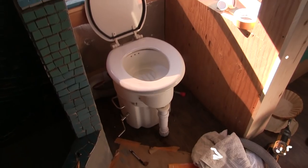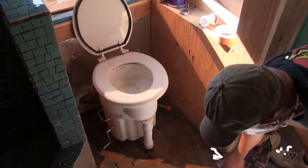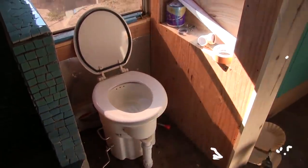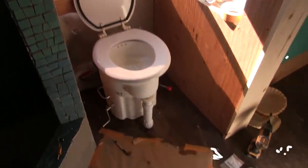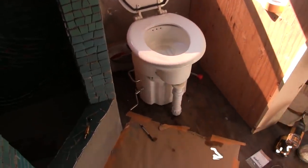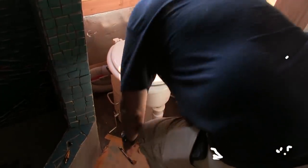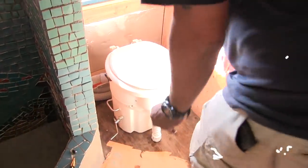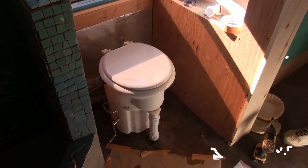It looks totally normal — just a different kind of handle, a turn crank instead of a flusher. I love it. I'm really happy with our choice to go with Airhead. No regrets, none at all. Back when we first got this composting toilet, we really didn't have any intentions of piping it to the gray tank. We were just going to do a conventional install, but over time that changed, because of the wisdom of other channels we've been watching — at least three different people very transparently told their audience that they had overflows from the pee jug in the middle of the night.